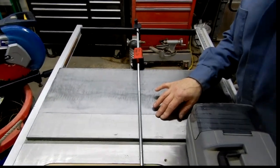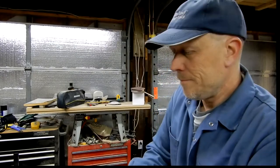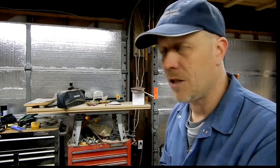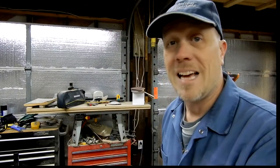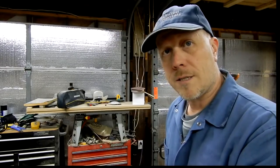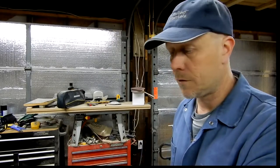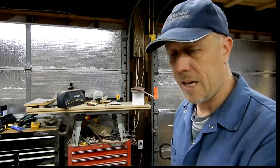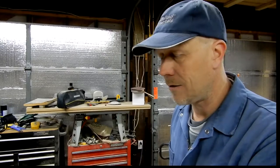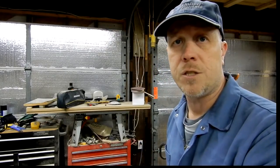The wing came pretty gooped up, which most cast iron surfaces are, and it needed a little flattening. I took my flattening stone to it and it had a few burrs here and there. I'm going to take you through the process of fitting this onto my Rigid — I have a Rigid R4512, it's a hybrid saw. It came with the sheet metal wings — why sheet metal? Just give me cast iron. I know it's costly, but whatever.